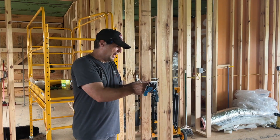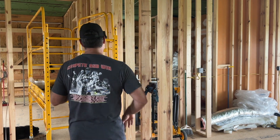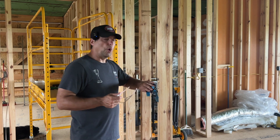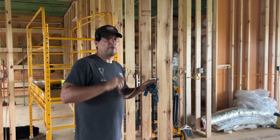Wear safety glasses when you're doing your rough-in. Take your wires, coil the ends up into the box. It also prevents scraping your arms on them or catching clothing, because the ends of those when you cut them can be a little rough. So coil your wires into your box, wear your safety glasses, and be careful on the job site.